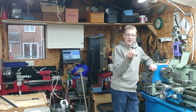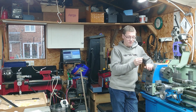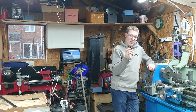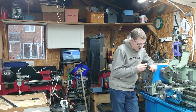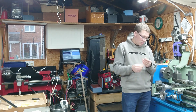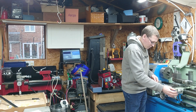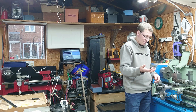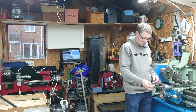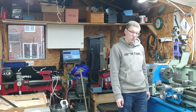There are many ways to skin this particular cap, but on this occasion I'm going to use the new CNC lathe just to give it a run. The benefit is I'm going to make them out of plastic, so it's a bit less scary. I'm going to make two — one for this lever down here where it's crumbled. This one's still good, but I've got a round knob on this one that was just one I had kicking around, so I'm going to replace it with a matching knob so that it matches all the rest.